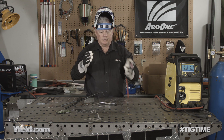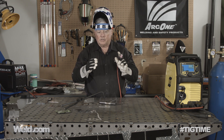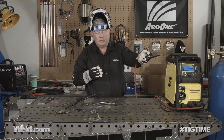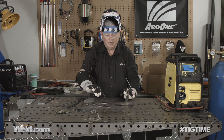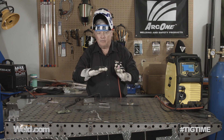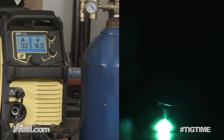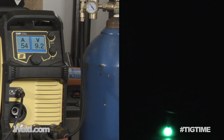I did that wraparound all in one swoop. Now, before I finish, I'm going to do one more test. I want to light an arc on a piece of metal and back off — go as low as I possibly can before the arc extinguishes. We're going to get a full view of the live amperage on the front here. I'm going to light an arc and just back off very, very slowly. I'm starting to back off — I don't know what the amps are but I'm backing off very slowly. Voltage has got to be getting down pretty low as well. I continue to back off the pedal and you'll see the amperage drop and drop and drop.